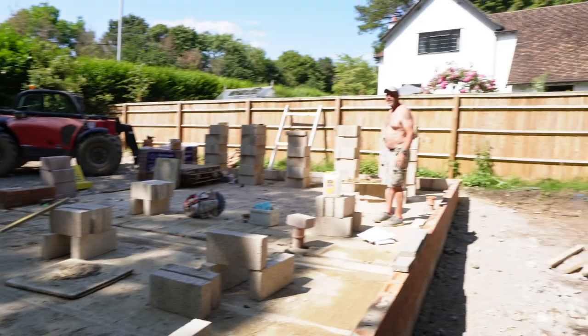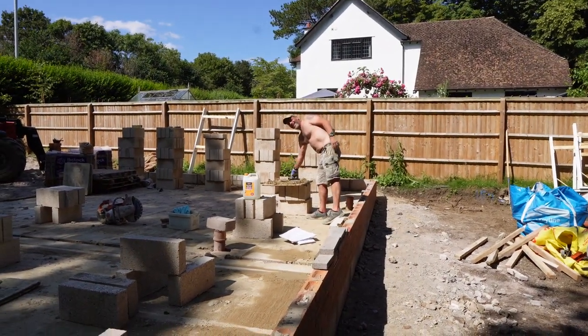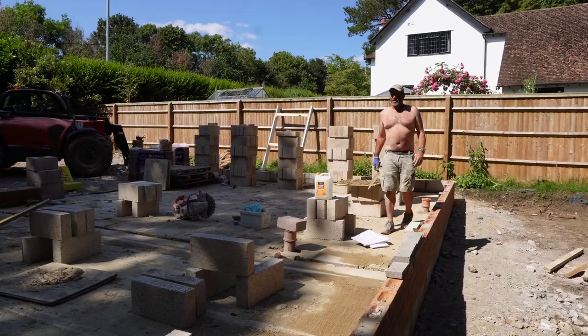It's a big old lump of a house now - once you've got the brickwork around you start getting a shape and a feel for it. I'll be able to get in here and see what the kitchen layout is going to be like because I want an island. This floor will stay like this because we've got underfloor heating going down - it'll be left until the end and then the insulation and membrane go in, and then it'll be screeded right at the very end once the floor heating's all complete.